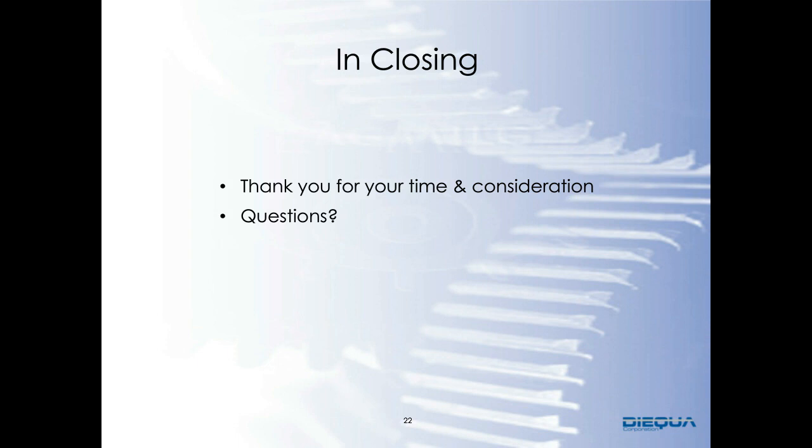And Tom, how does your reducer maintain those levels of backlash? Well, first speaking to the utilization of 90+% of worm ring to worm shaft engagement, this ensures more wearing surface, also higher shock load capacity because we're distributing the use over a broader area. Speaking to the expert version, during construction of the unit, the technicians assemble and then confirm that we have met the backlash expectation, in the case of the expert, less than 1 arc minute.